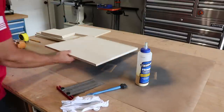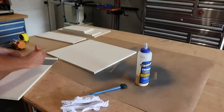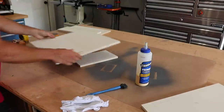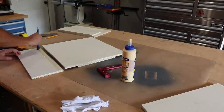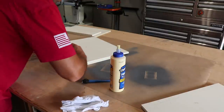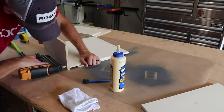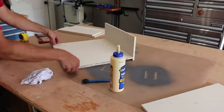To start, we'll need the back plate and the two side pieces. Here I'm using my T-rule to draw a line three-quarters of an inch from the back edge to act as a nail reference line. Then, using some half-inch plywood pieces to raise the back panel up for the correct spacing. Make sure your pieces are square-ish, and follow up with glue and some brads. Then just rinse and repeat for the other side.